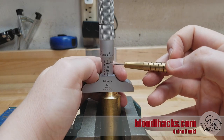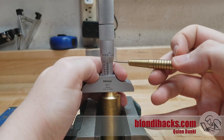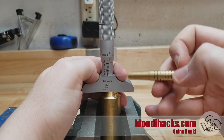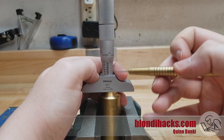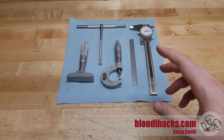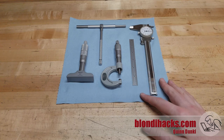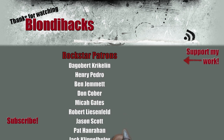When practicing with this tool, a great thing to do is use the depth blade on the caliper to give you an approximate depth — that will tell you if you're roughly in the ballpark. Because if you make a mistake and read the scale in the wrong direction, your measurement will be quite a bit off, and you can sanity check it with the caliper. Take the measurement multiple times and make sure your arithmetic is right each time. That is all the basic types of measurements you'll need in the home machine shop. Links to all these tools are in the description below — thanks very much, we'll see you next time.